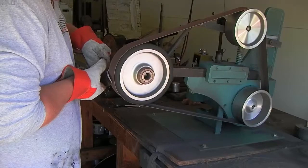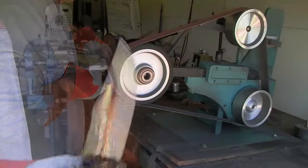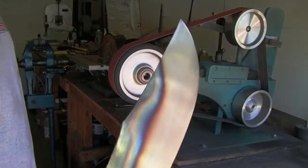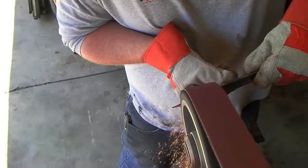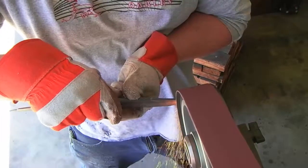The blades are now ready to have their top clips ground in. If using a non-variable speed grinder, make sure that the blade is dunked in water frequently during this process so that the tip of the blade does not heat up and soften. A good 8-inch wheel attachment on the grinder is perfect for grinding in clips.